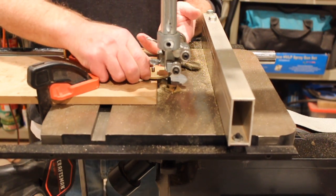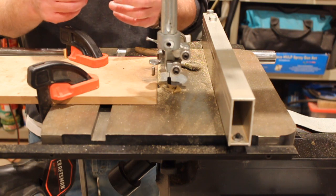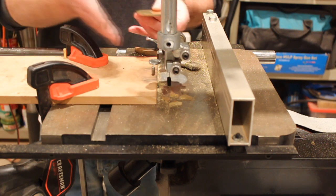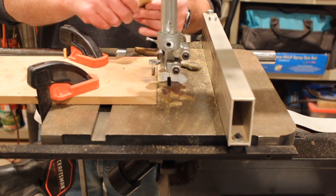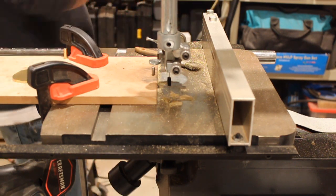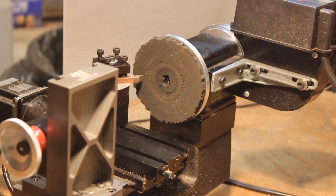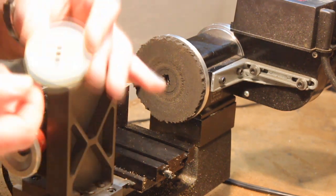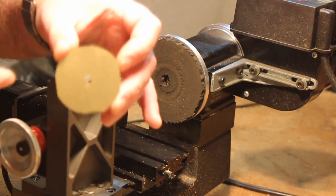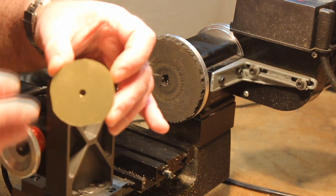That's really all there is to it. It's not exactly a circle, but like I said, the lathe will finish it up. You'll be tempted to make this tighter so that it's closer to a circle — my recommendation is not to do that. Let the lathe do the work. I've completed the process of turning all the squares into what I call almost circles. They were done on the bandsaw, so they're not perfectly round. But in a little while, we're going to use a lathe to turn them perfectly round into the exact dimension that they need to be for a gear blank.